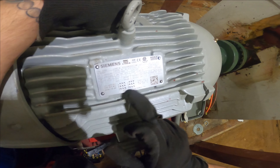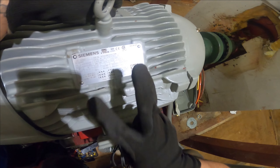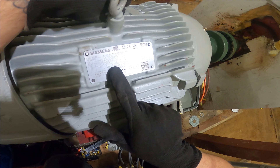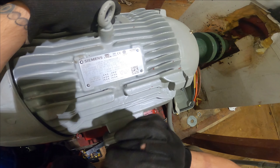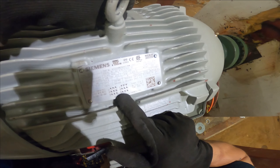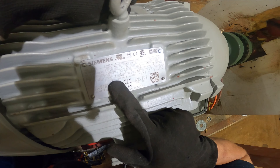There are two ways to wire this motor, as there are two voltages — two sets of windings within the motor. This can be wired for 230 volts or 460 volts. In our case, we're using 460 volts, so we're going to use the diagram that states high volts. The low volts diagram would be for 230 volts. So we're going to focus on the high volts.